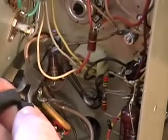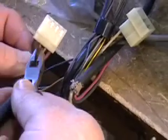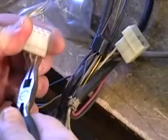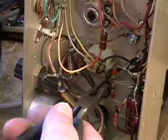And when you trace the wiring for this, you'll see there's a little brown wire going to that first position, and you'll see that it comes up into one of the positions of the connector for the 4-pin, and that's this one right here. And you'll find the other one is the braid. The braid comes through and comes down into a black wire here, which goes into chassis ground.